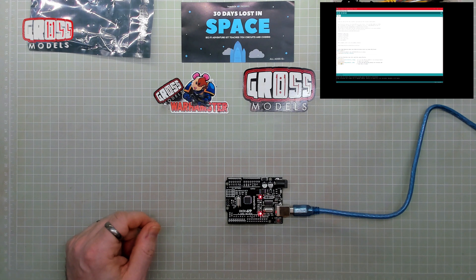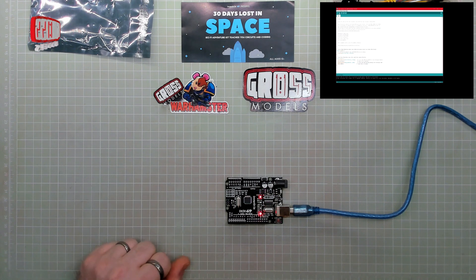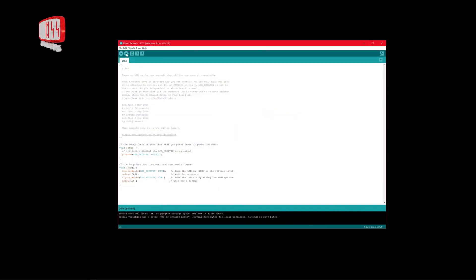So already after day one, we've not done anything other than learn how to use the board a little bit, but it seems I can figure out how things work. You can play around with the numbers and change them. I've changed it to a thousand and five hundred, so it'll be on for a second, off for half a second. It does give you things after the program — by putting these symbols in, it just means ignore this, so it's like user comments. It's telling you what it's doing, and they encourage you to put your own comments in so people following can see what you've done and why, and even yourself going back if there's a problem.